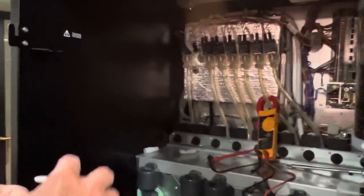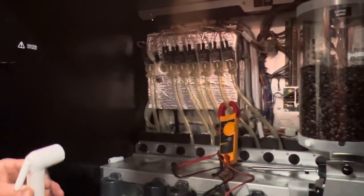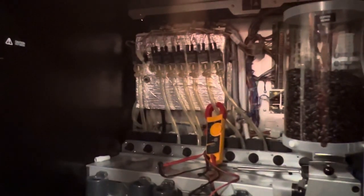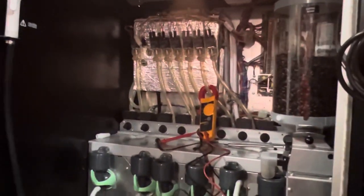What a lot of times happens is a temperature probe will get some scale built up on it, so it doesn't read the temperature exactly right, and the tank will overheat. And that's why one of those will open up and trip. Is it possible to overheat and not show the temperature outside here? In other words, if it was overheating, yet was saying 82 degrees? It could, if that sensor was really bad, but I don't think it is. I think it's just...